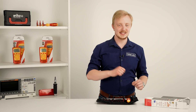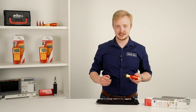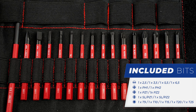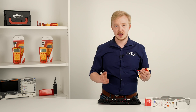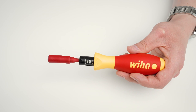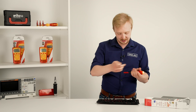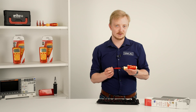The first important difference is the VDE certification. These tools are safe to work on voltages of up to 1 kV AC — that's why they are more colorful. Here you get more: 15 bits, all made with slim technology — a thinner design with the same level of protection. For mounting them you get an adapter, the Torque Barrier S electric for slim bits, with a locking mechanism on the end. This makes it different because the whole thing is just longer and the bit is secured with an extra lock.